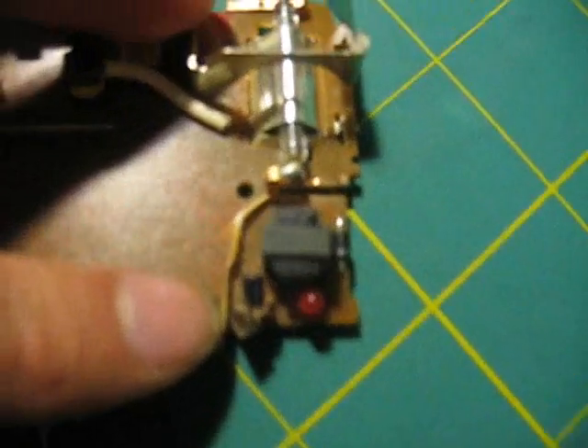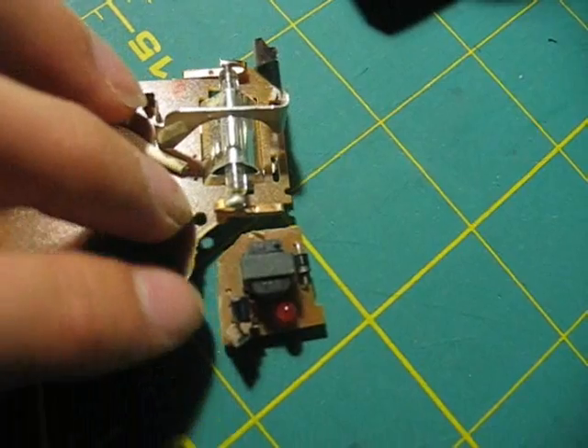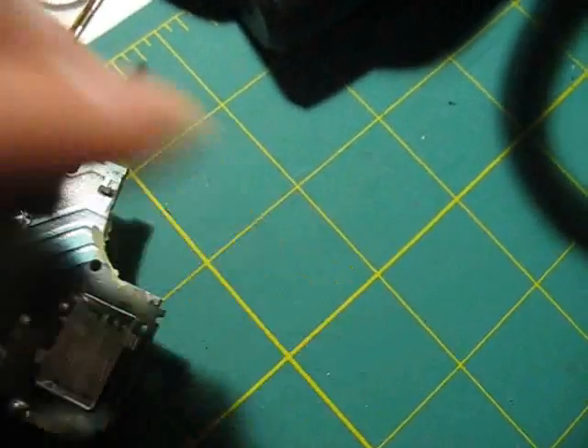You need the Kodak camera, and you just rip it apart and you get the circuit. Now in the circuit, you'll find in the top corner — you can see there's a portion already cut out using my Dremel. You can use wire cutters, but there's the problem of the circuit board probably cracking, so I just used a Dremel or a saw to be careful.